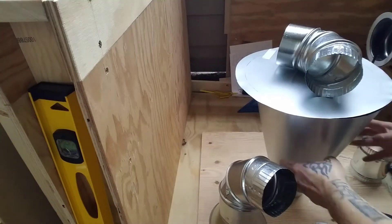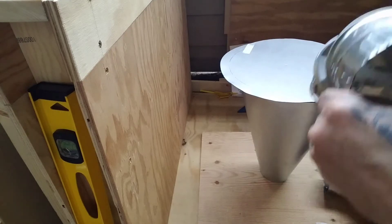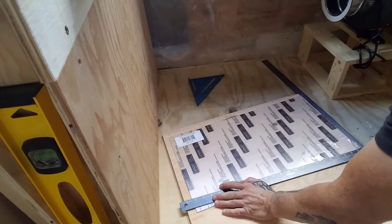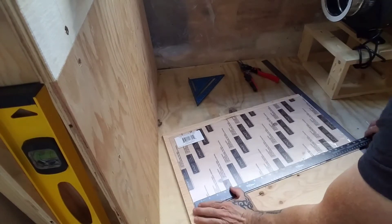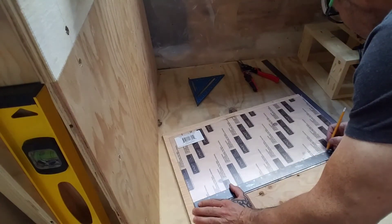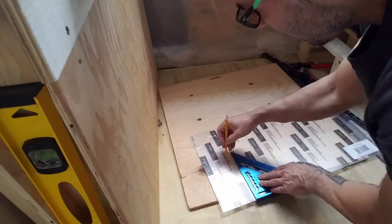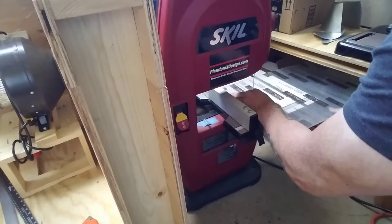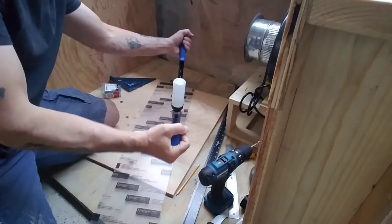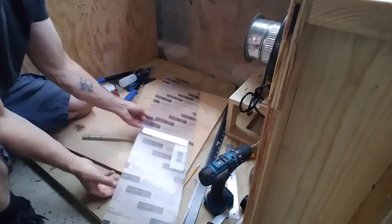This gives you an idea of the circle I just cut out and where it's going to sit in relation to the cyclone. Next I laid out the markings where I want to cut the polycarbonate — this is the part that sits at the very top and will be transparent so you can look through it like a window and see the cyclone in action. After cutting the polycarbonate pieces on the bandsaw, I cut some strips of aluminum and pop riveted the two polycarbonate pieces together to form a circle.